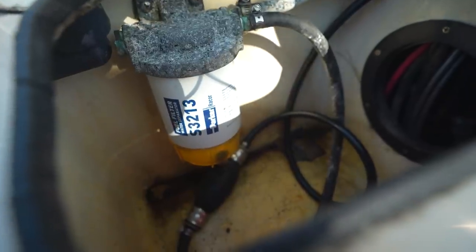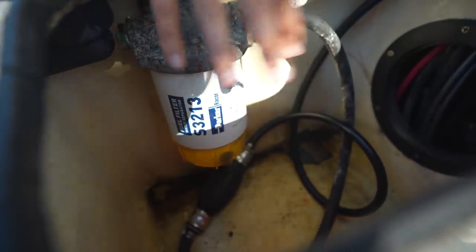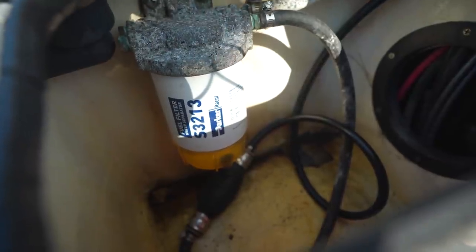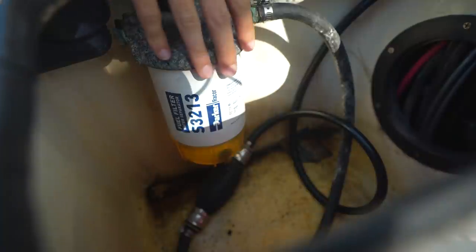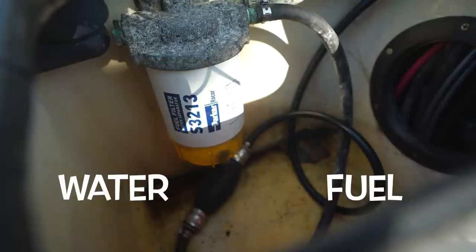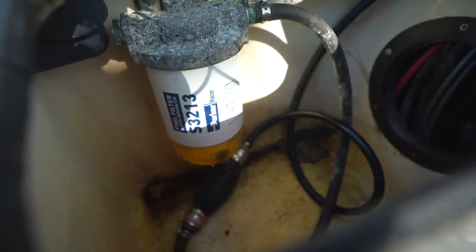The best thing to do is make sure you're getting your maintenance every 100 hours and that your marina is replacing your fuel water separator. Right now you're looking in the bilge at the fuel water separator — most of them look just like this. The fuel water separator separates water from your fuel before it enters the engine — it's the step between the fuel tank and the engine. If it fills up with water, a sensor will trigger an alarm warning you.